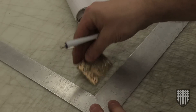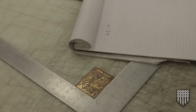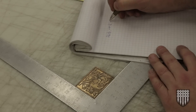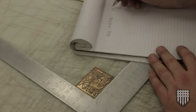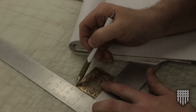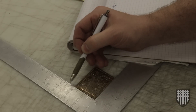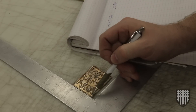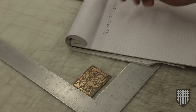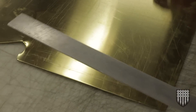We have to do a tiny bit of math. With the padding around his head we've got a measurement of 26 and a half. Because I'm gonna put a bracket behind it I want to add another half an inch, and then an overlap of plus three quarters of an inch, so we're looking at 27 and three quarters. For the width the plate measures an inch and just over seven eighths, and I'm going to put a quarter inch bead roll on the top and bottom, stepping it up a quarter inch at each edge — so we'll call this two and a half inches of material. 27 and three quarters by two and a half inches is what I need to cut out of my sheet of brass.